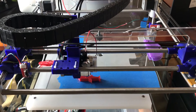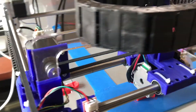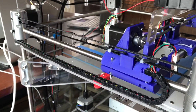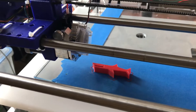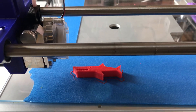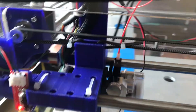Here's the reworked Bits from Bytes printer in action. You can see we've done away with all those big aluminum components and are now using the E3D Titan Aero extruder, along with the 3D-printed parts that replace the aluminum items — made in Inventor, reusing as much of the wiring as possible. I'm printing out Jaws right now. By tradition, every time I do a printer the very first thing it prints is a copy of Jaws, going back to when I got my first printer, which was a wooden Printrbot Simple. It just finished — so there it is. I've got some minor tweaks to make before I upload everything to Thingiverse.